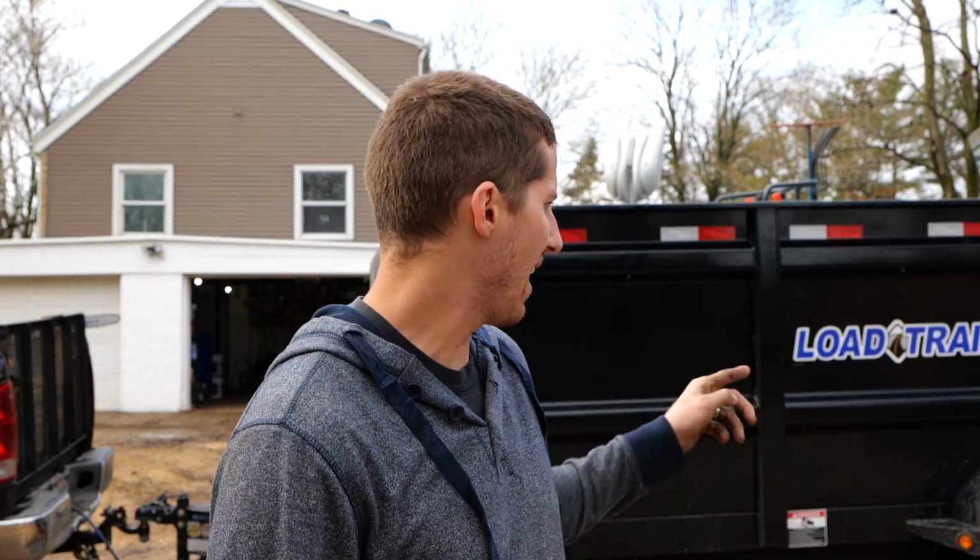If you have a shorter dump trailer than this, you're going to have a hard time carrying any sort of load with the machine. You can build the load around it by hand, but as far as loading it with the machine, remember that you're stuck with driving up and then either driving down dangerously or turning around in there, and you need a certain amount of room to turn around safely. It's really not a good idea to turn around a machine like that behind the axle. I wouldn't risk it. It's too close to the edge, too many mistakes could happen, and you'd have to call a crane or something to rescue you. I don't know what you'd do.